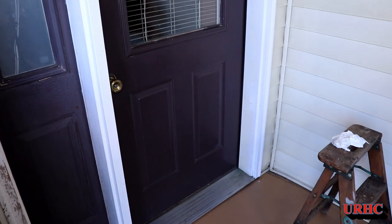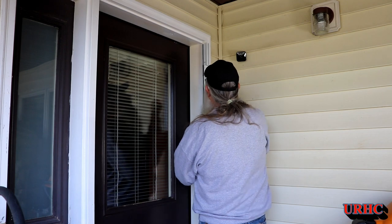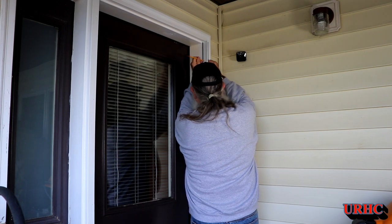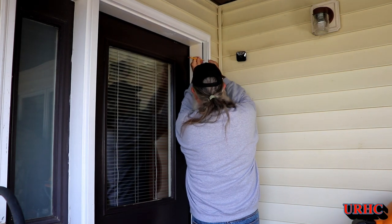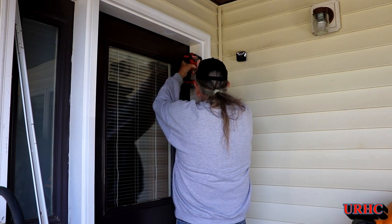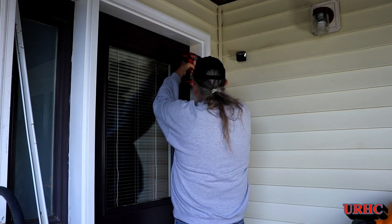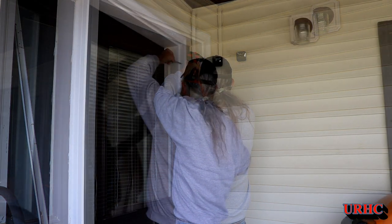There, I got that just kind of touched up for now — in the spring I'm going to repaint the door and everything else. For the new door, the first thing you do is put on the hinge side extrusion. You just hold it up in place and mark this one keyhole slot. You have to drill a pilot hole and then put in a screw to hang the door when you first start putting it up, because the new door is an extremely heavy door with all double insulated glass in it. So this sort of gives you a little helping hand.